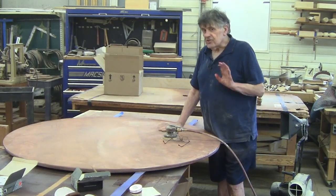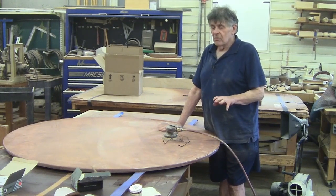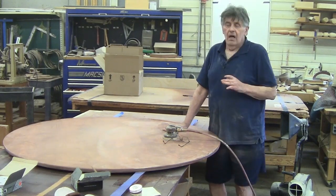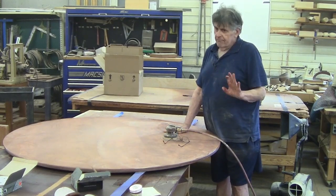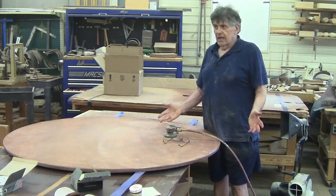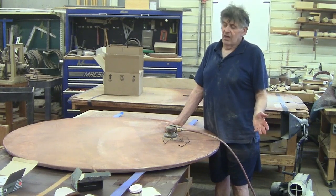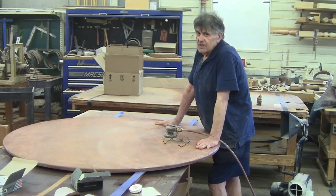But if you're using a solvent base, no matter what you do, remember, one coat will soften the other one. You can go through and do this, but pretty much no matter what you do, you can come away with that top as slick as glass. Now, again, an exception would be a post-catalyzed product like a conversion varnish. You're going to see that grain shrink back. Water-based does not do that. So what you see is what you get.